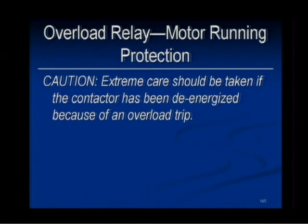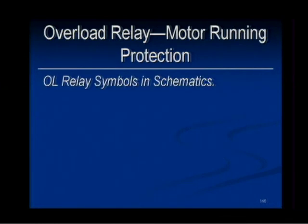If the circuit breaker tripped or the fuse blew, it isn't like, well, let me just press the reset button and we're fine. Or let me just go ahead and close and disconnect again. Or let me go ahead and replace the fuses. We've got to find out what happened. You said, Dan, we put an amp meter on there. Something had to happen. Why is this thing drawing? Why did this thing burn out? You don't want to be going in there and resetting that without knowing what the condition was.